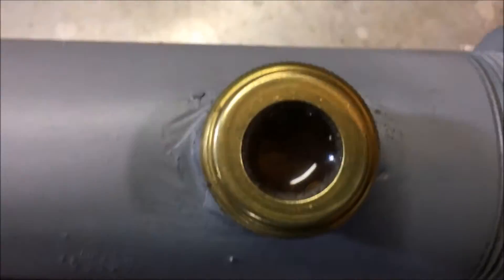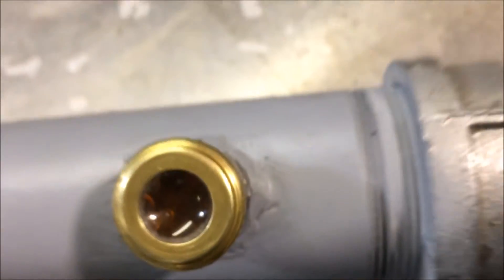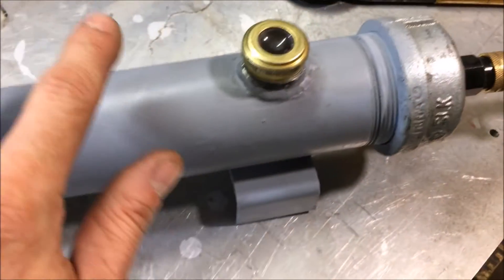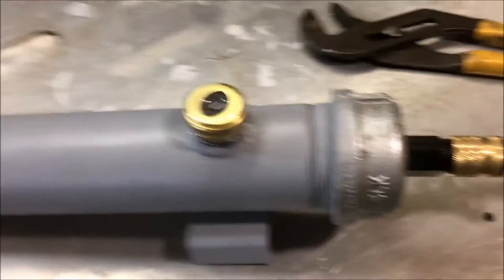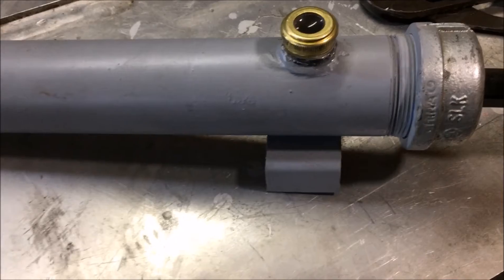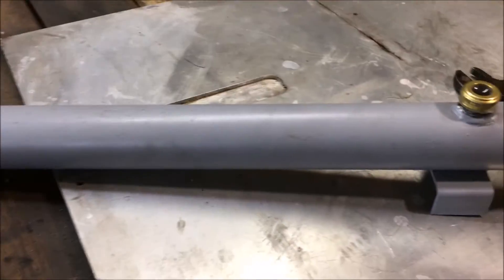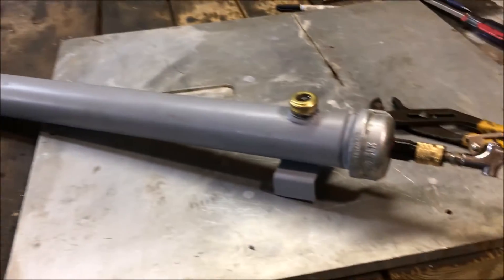Inside this thing is indicating desiccant silica gel beads. They go from an orange color to a dark green color when they're fully saturated. When they are fully saturated, you take the end cap off, pour the beads out onto a cookie sheet lined with aluminum foil, and bake them at about 250 to 300 degrees until the majority of them turn back to orange. You'll get about 98% back to orange color. Let it cool down and as quickly as possible use the foil as a funnel to pour it back inside the unit.